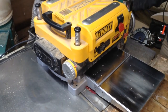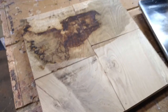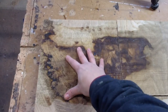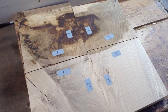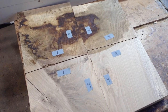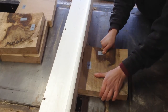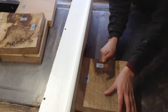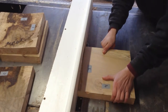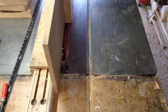It wasn't a flat slab when I cut it and it definitely wasn't flat now that it's in four pieces. So in order to get the pieces not to rock, I just planed down both sides so they were flat enough. Then I rearranged it the way it was before I cut it and put numbers on all the pieces, because I only needed to flatten the sides that were going to touch each other. I have my jointing jig and table saw so I could joint all the edges that will be touching and remake this slab.